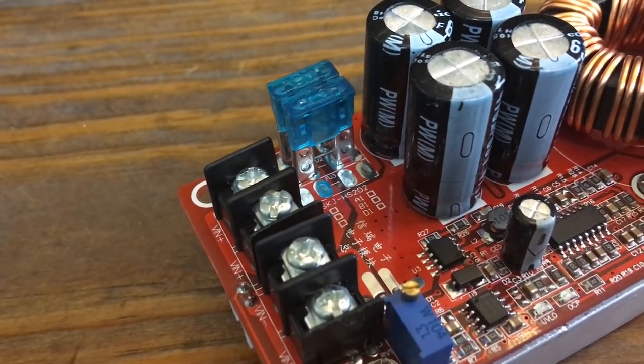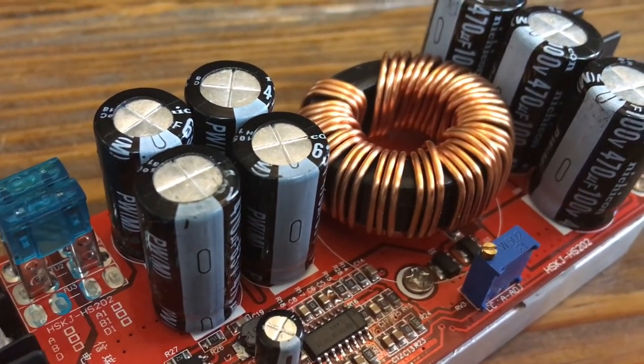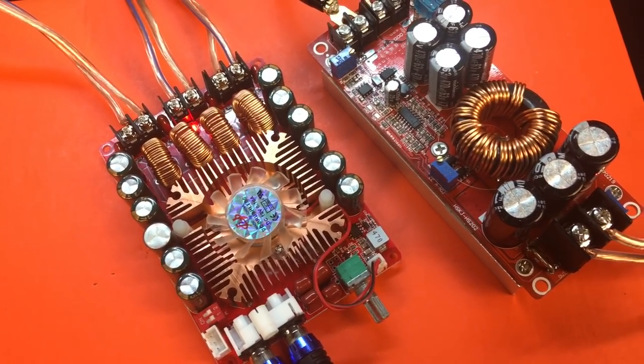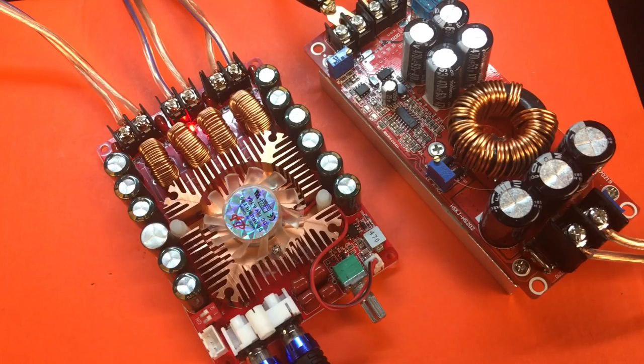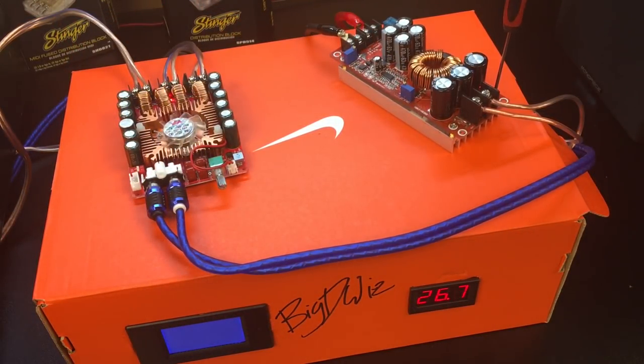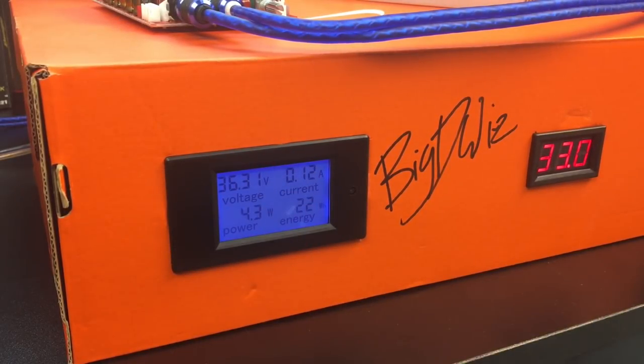For the test I used a 1200-watt booster that took input from two 12-volt lead-acid batteries and boosted it up to 36 volts. I'll do a separate video on this booster itself — it's a really cool way to boost voltage for an amplifier like this. I used the voltage adjustment potentiometer on the booster and ramped up the voltage, but I got to around 33 volts and it just stopped. Turns out — you big dummy — the voltmeter on the right was a 30-volt voltmeter. I needed a higher voltage voltmeter!